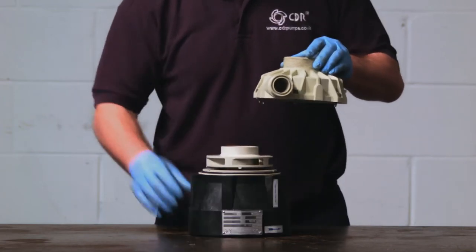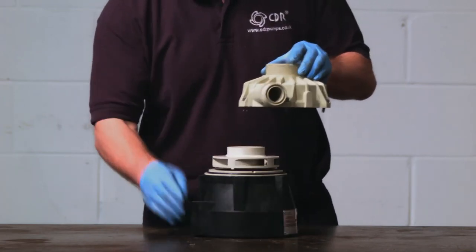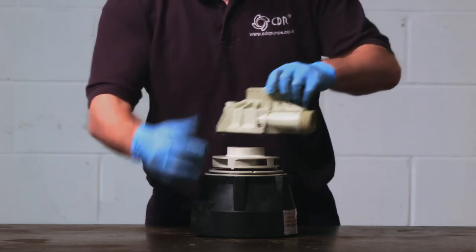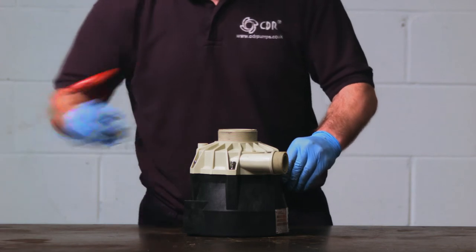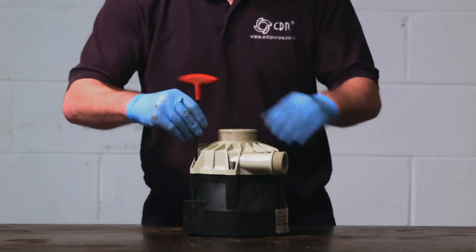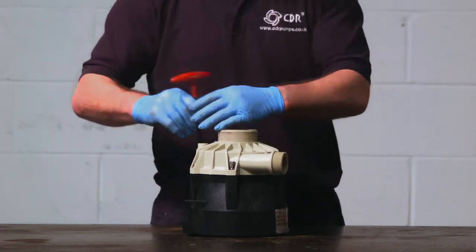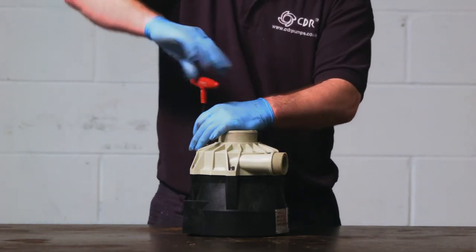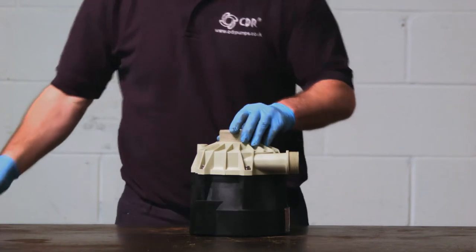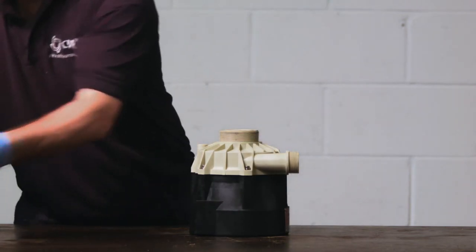With the second axial thrust, make sure that the grooves face inwards and ensure that the area is clean. Replace the o-ring — we advise replacing the o-ring during any repair or service. Replace the casing and then secure the cap head screws, ensuring to tighten across the pump and not rotationally, and to the correct torque settings which will be in the manual.